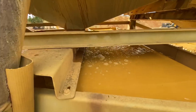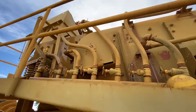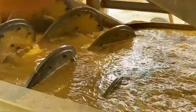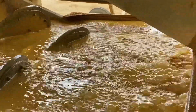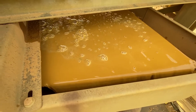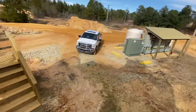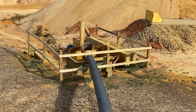Here's the swimming pool. So that sand has gone through the shaker and then gets dumped into the tank. You see it kind of bubbling out there, and those screws are just agitating it and washing all the silts and clays off. They spill over the edge right here because they're lightweight. We're pumping about 1,000 gallons a minute into here and we kind of just float off all the stuff that we don't want. You see it going over the side — it goes down to a pump there and we'll explain what happens there in a little bit.